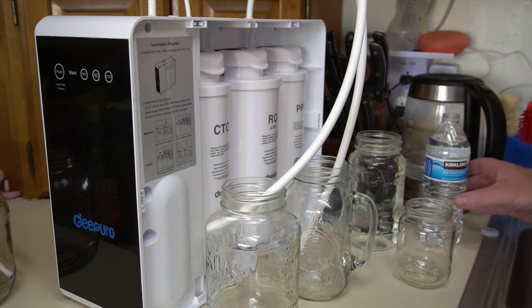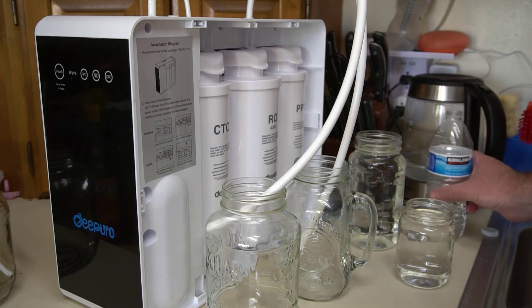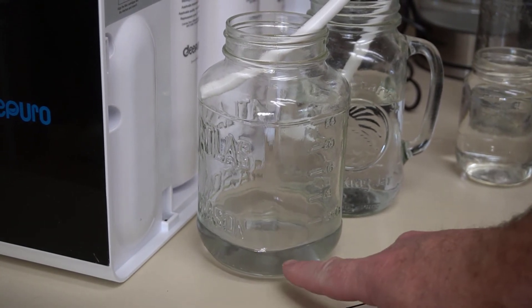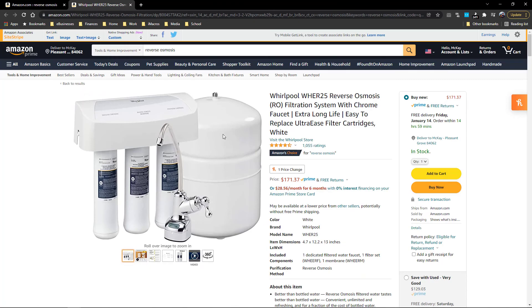Your tap water has minerals, so it has a fairly unique taste — you've probably noticed that when you travel around the country, the taste of tap water is slightly different everywhere. If you like the way your water tastes and have a safe reading, you probably don't need a reverse osmosis system. However, if you prefer the taste of bottled water over your tap water, that could be a good reason to get one. Also consider the styles: a pump-based system like this one has good consistent pressure but you will need power under the sink and you will hear it running. A water-pressure-only system is very quiet but can have low pressure depending on your water pressure and filters. I have some links posted below and some thoughts on this filter if you want to read more — and if you have any questions or comments about reverse osmosis, please leave a comment below.